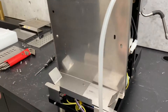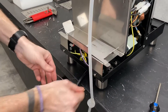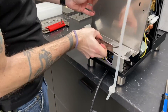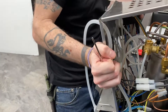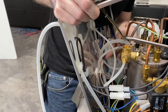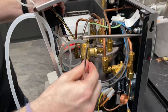If you need better access to the top of your boiler, there are two screws right here — two and a half millimeters. So for the most part it's Phillips head, but if you need to go the rest of the way, these are the ones. Once you have those off, you can swing things a little bit more out of the way. You may need to disconnect the wires, or you can keep things connected and just have a little more access. Keep in mind that if you do need to take this completely off, you have wiring clipped on the back and tubing here, so there's a lot to take off and put back correctly. I usually just swing it out of the way — one less thing to worry about when putting everything back together.